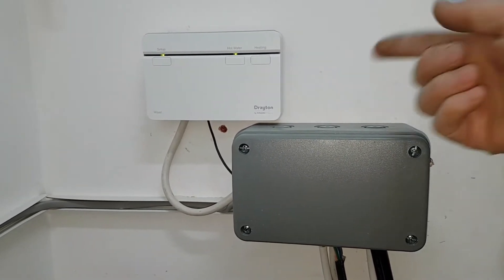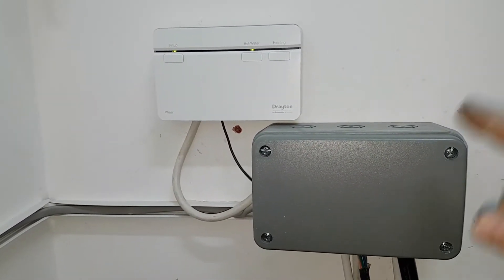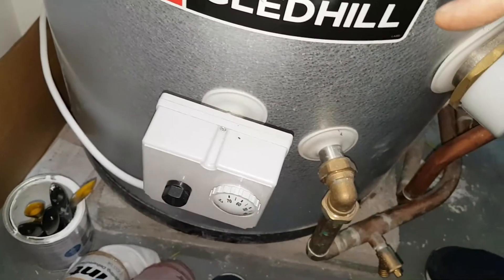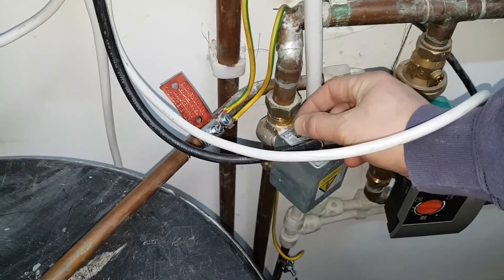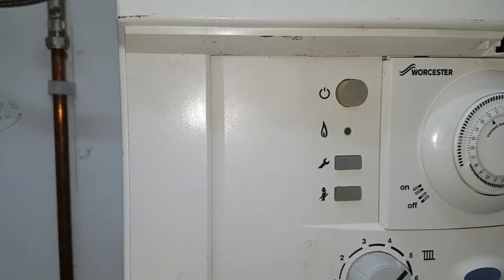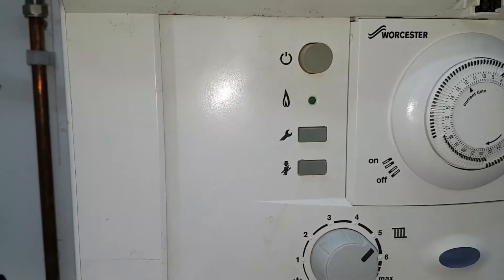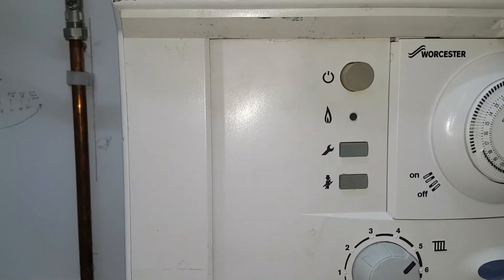So this Wiser box has three outlets: two for heating, one for hot water. The hot water had to go to a cylinder stat which is down here. So that's the cylinder stat there — it activates the zone valve. Once the zone valve opens fully, it fires up the boiler. So the boiler is currently on. We're going to demonstrate by turning down the cylinder thermostat so the boiler goes off. The burn light has gone off now — so you can see it's been controlled properly.